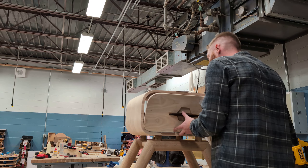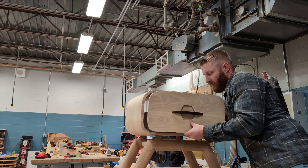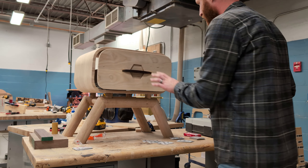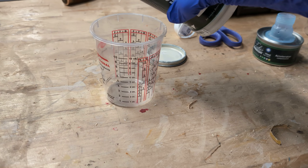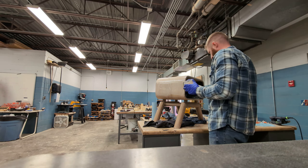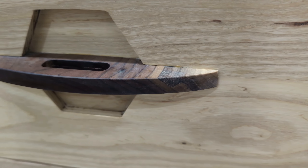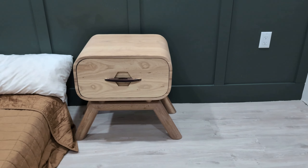After that glue dried it's time to put the face on this drawer front. I use the double-sided tape method and the playing card trick to get an even reveal all the way around. The tape is fairly strong but you still got to be a little bit careful when removing the drawer so you don't shift that face, and once you get a couple of screws in it you don't have to worry about it anymore. You got to love that soft close finish — and this is my first real look at it all together. The finishing touch is some Rubio Monocoat, a hard wax finish — you just wipe it on and buff it off and let the wood do all the talking. That wraps up this project. It was an uphill battle from the start but I'm really pleased with it. Like, comment, and subscribe — I don't get a ton of views on YouTube and I'd love to change that, so any feedback would be greatly appreciated. Thanks for watching.